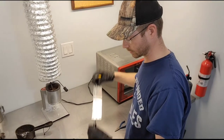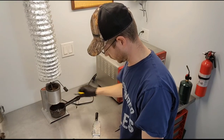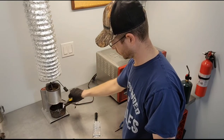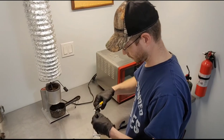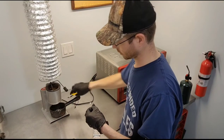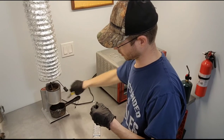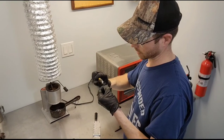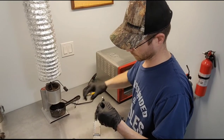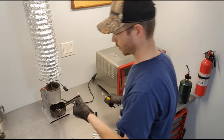Sometimes you want to let them cool just a little bit — a little more solid at the sprue. Clip that sprue off again, then just take your flush cutter. Look at all that excess — you don't want that on there. I just scrape along them a little bit. Try not to make any lead dust — that stuff is pretty wicked.